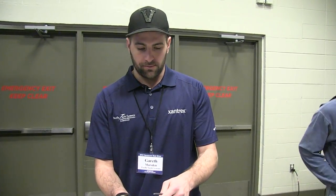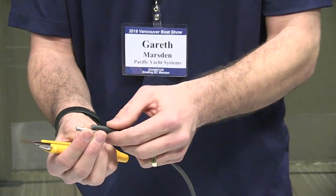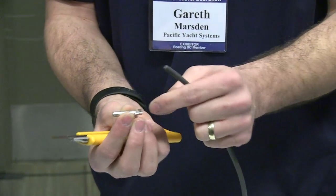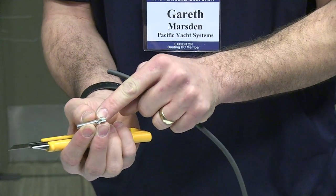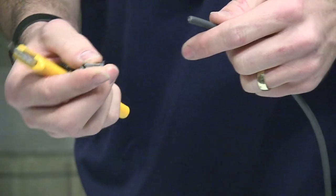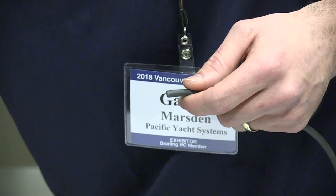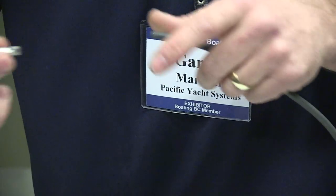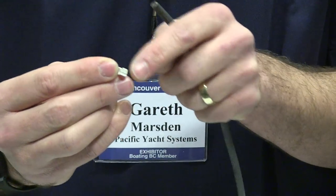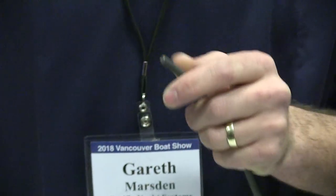This actually is, like, you can feed the cable right through. So obviously you don't want to strip it back that full distance. You just want to get enough to get under the crimping part, which is this first quarter inch on the solid bit on there. And then same for the male end. It's this one here, you can feed the cable up more, but it only has to really get under the connection there.